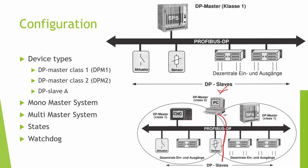What do we normally do when something stops working? Plug and unplug, right? You just unplug the thing from the wall for 30 seconds or whatever. Maybe you press and hold the power button while you're doing that, so that way all the capacitors and things like that lose all their charge. The TV tries to turn on and the capacitors all lose their charge. And then you plug it back in and turn it back on. You're like, oh, there you go, now you're working just fine. I mean, that's always a good go-to system.